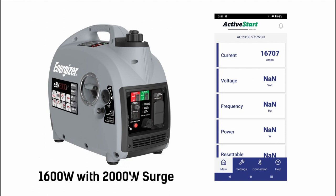Next up was my little generator — a 1,600 watt unit with a 2,000 watt surge, your typical so-called 2,000 watt generator. I tried it in Econo mode and full RPM and got the same results. You can see on the screen the air conditioner didn't start. The generator kept running but the soft starter shut down, showing crazy amp readings and then a NAN error. Also in all these tests, I first started the air conditioner fan so only the compressor was kicking on — no fan startup load. That was another fail.